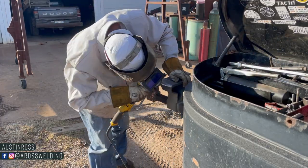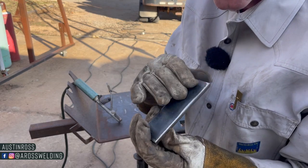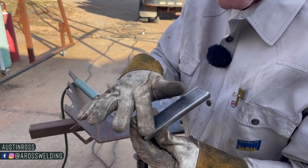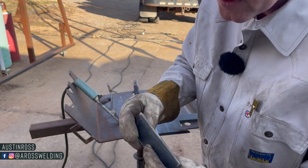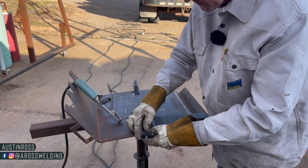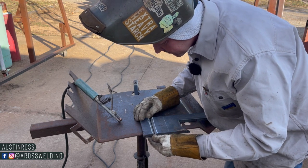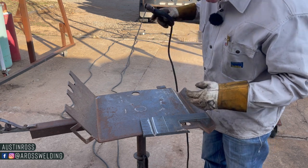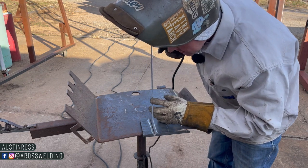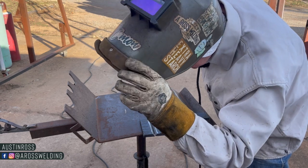Alright, so I've got about a nickel landing on the end. I sanded the mill scale off the back and off the front. I'm gonna go about a nickel space as well. I've got my machine on 135, I believe — I've got a 1/8" 6010, it's in the 150 range on that SAE 300 of mine.